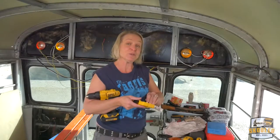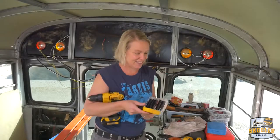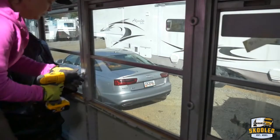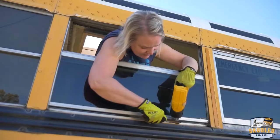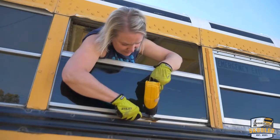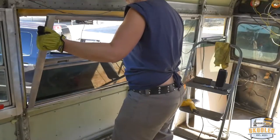I kind of thought that pulling out the ceiling was a really big effort, but that was only because we hadn't actually started the windows yet. First you have to take the window out, which means removing the screws on the side, scoring the old seal — a heat gun helps a lot with that — and then slowly but firmly and carefully pull the window out.